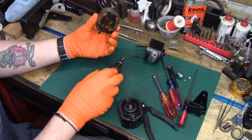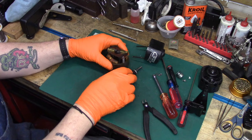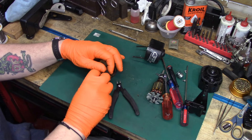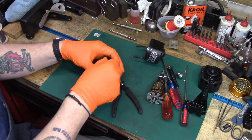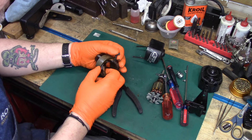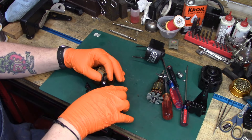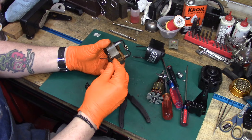You can see that our commutators are pretty gunked up. Somebody has been in here before. We're going to do a little dissection here and see if we can get this old tape off and find out how bad the glob of solder is under this mess. It's not as bad as I feared. I can see what they did when they made this - the two conductors both go in on the one coil and there's a jumper wire that goes across from the factory. So we're going to have to attack this a little differently than I would most motors made by Singer.